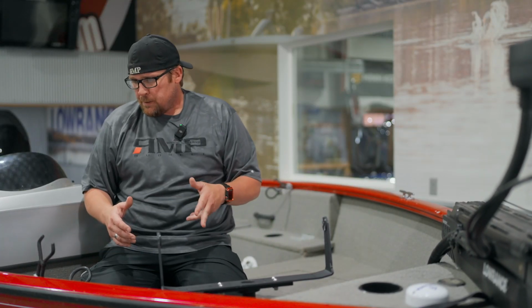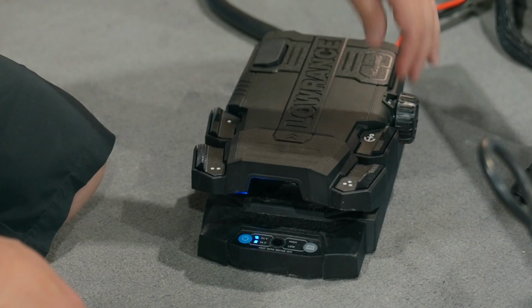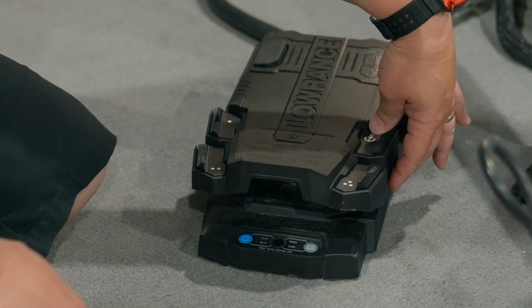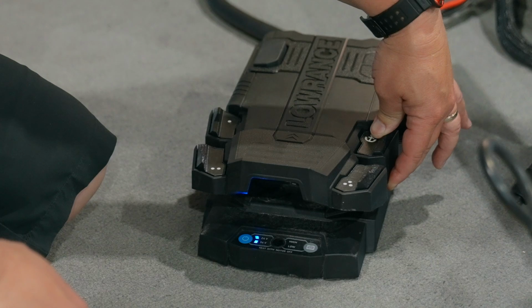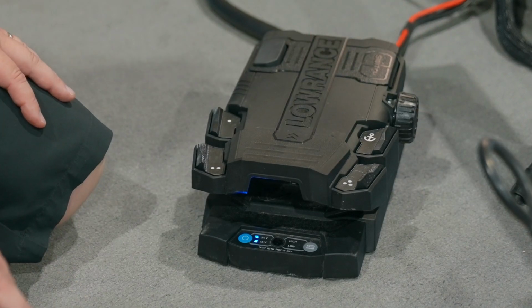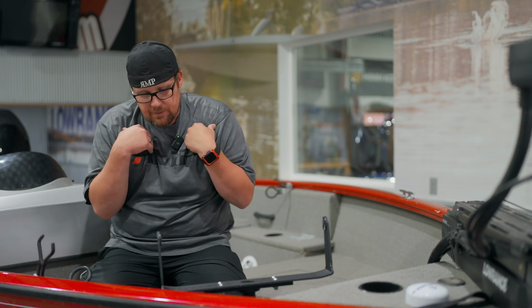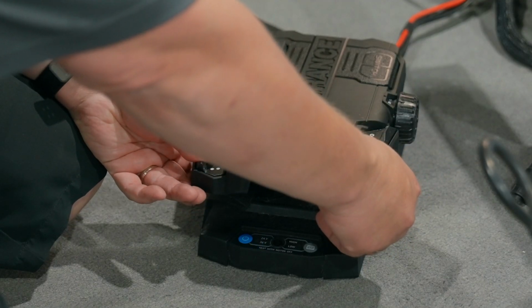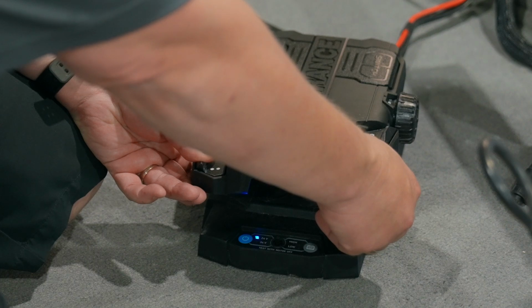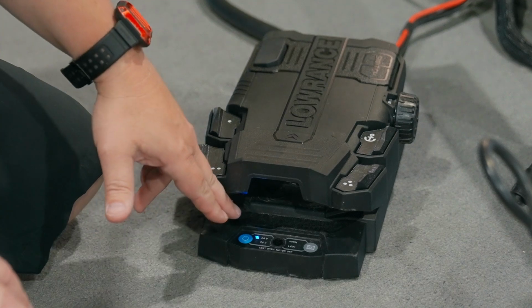So now we're going to press and hold the anchor button. While it's in configuration, we've lined it up, we're going to press and hold the anchor button. And then once we release it, we get 3 beeps up there. It flashed on the arrow, flashed 3 times. And then what we're going to do is exit configuration mode. So we're going to hit our bottom 2, left and right, 2 and 3, press and hold. Get back out of configuration mode. We go back to our 24 volt.